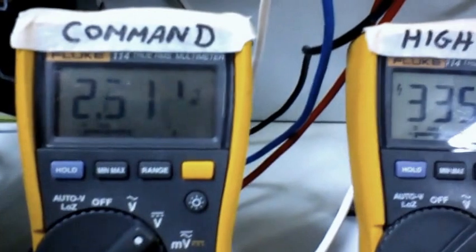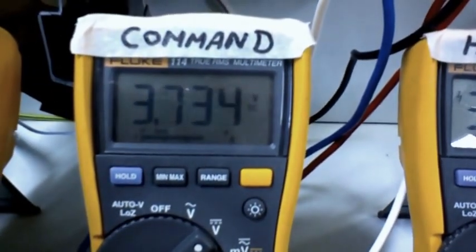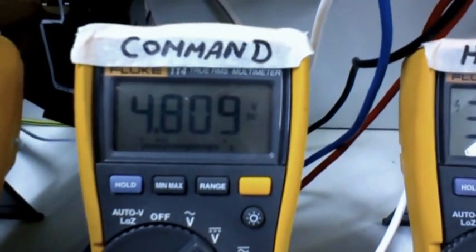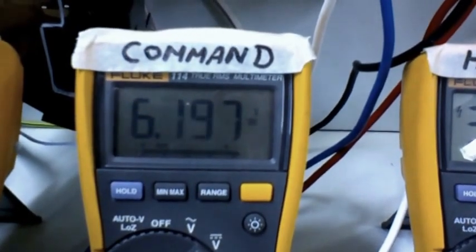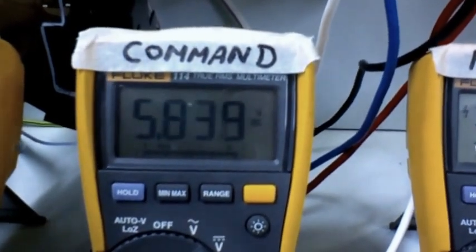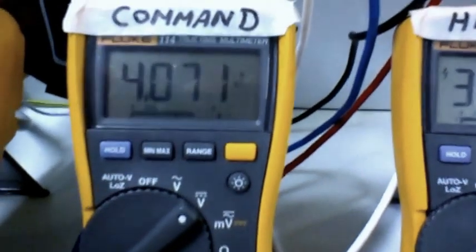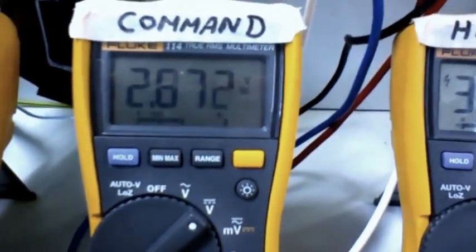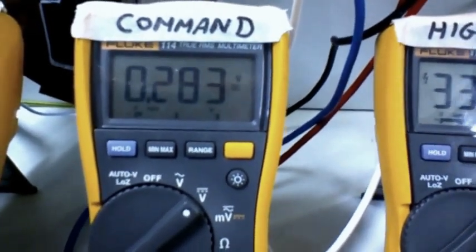Here we go, it's starting again - just watch that voltage skyrocket up. You can see it's going well above that three volts where its maximum speed was, and we're going right up hitting that six volt - in fact over six volt - margin, but we're not exceeding it. So you can definitely see it gets one to six volts. What's actually happening is the motor is being sent a high command voltage to try and achieve an RPM back, because the board is not seeing that rotation pulse signal come back, as I've interrupted it at the switch.